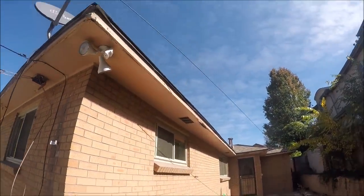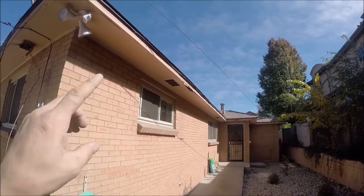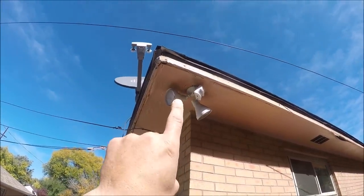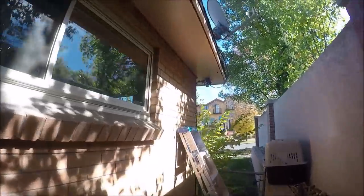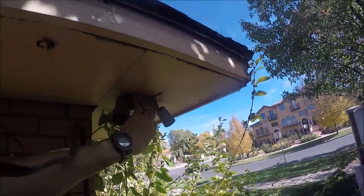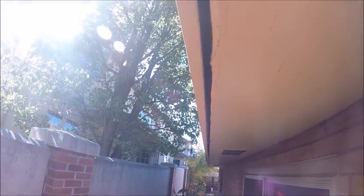As I said, I'm doing this house in sections. I'm going to do the back side and east side first — taking everything off and then completely replacing it with new soffit and fascia — then move on to the other side, and the last portion will be the street side. I also wanted to point something out: these lights don't all have light boxes. Some of them just have a wire run through the attic with a hole drilled. When I get to this section I'll be wiring in a box that's recessed into the new soffit so we can have a proper light fixture with a photo cell on it.